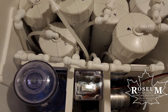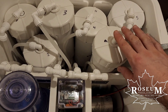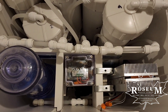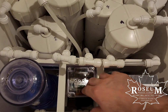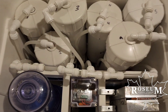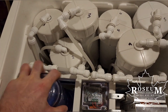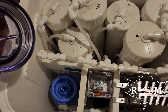The other thing — this was a bit of a challenge: sometimes it's hard to reach in here and undo our filter housing to change it out, especially now that we've added a sixth membrane and it's a little tighter. We still have our 120-volt heater on these heat sinks to distribute heat into the system and our temperature controller, so we can't really reach underneath all of this. So we actually flipped the filter housing upside down — these can be installed upside down, they work just fine — so you can just pop that off, pull it up, and replace your filter.